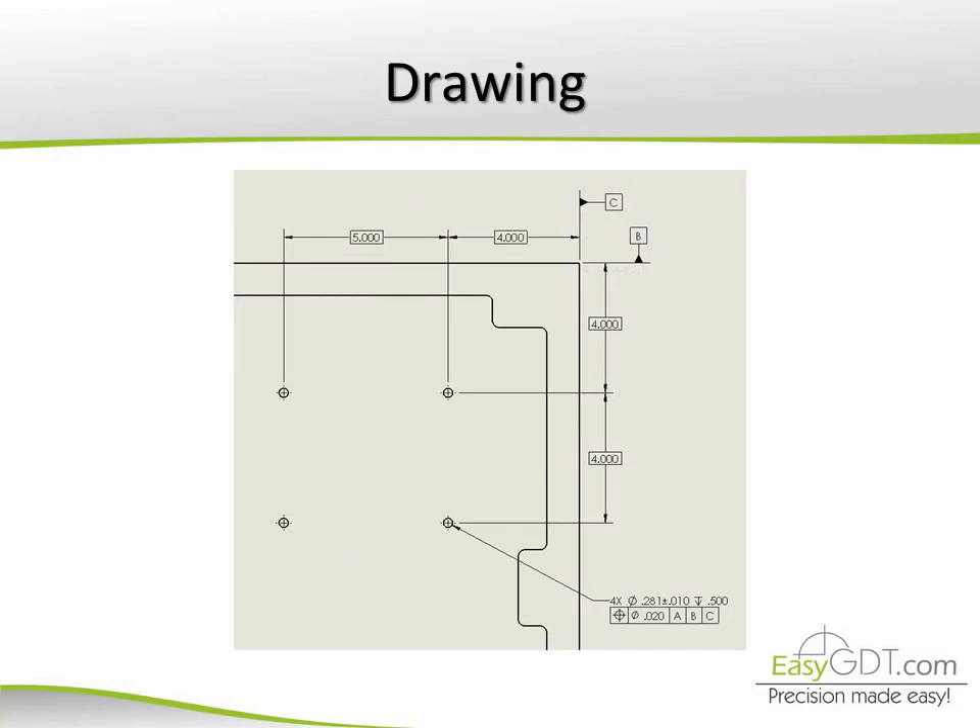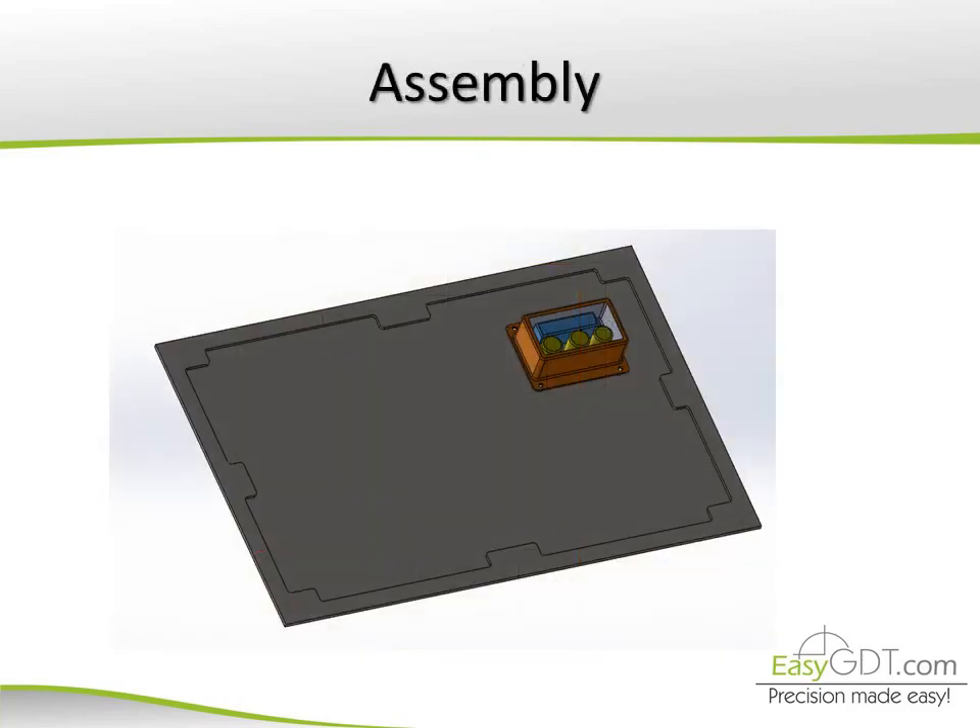Let's say some plates have been manufactured. One of them has 0.400 out of positional tolerance and is supposed not to be able to assemble, but it does when the box is placed on it. What may be happening is that the four holes are out of tolerance against the plate — because the datums are on the plate edges — but they're within the 0.020 tolerance between each other. So that's functional, that's okay. The part should be accepted because, in many applications, the box location is not as important as the holes' locations relative to each other.